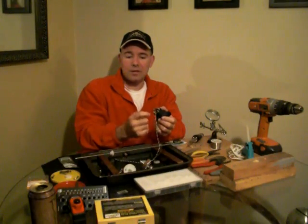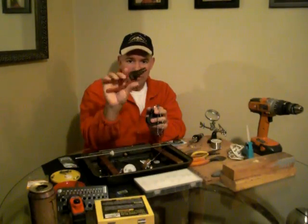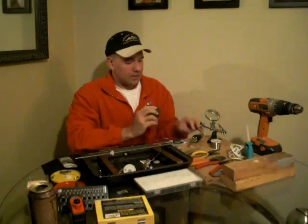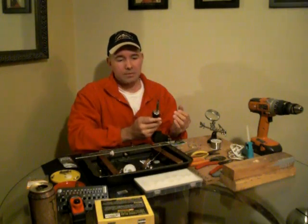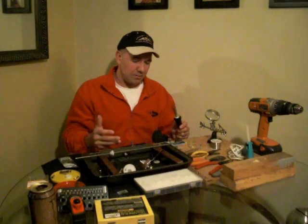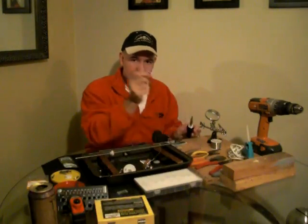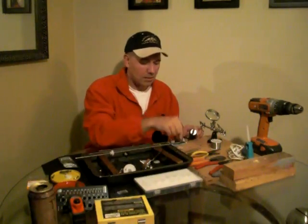This switch has six pins. The center one is the ground and the outer ones complete the switch. For this I needed three wires — white in the center and green on each side. You want to strip these using the smallest hole on your stripper, using about a little less than a quarter inch of wire on each connection. Let the iron heat up and be very careful — even being careful, I burned myself a little bit. The whole stem gets really hot and can give you a serious burn quickly. I did this on a glass table for safety. You don't want this on a tablecloth or anything that could catch fire.